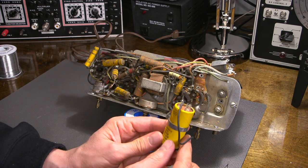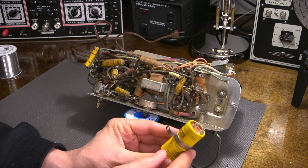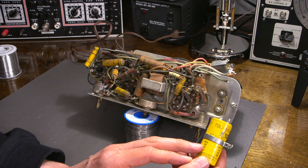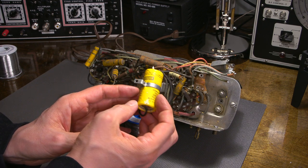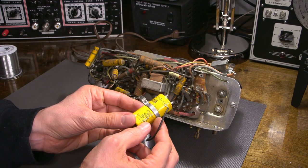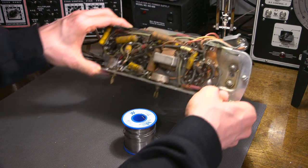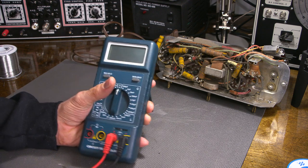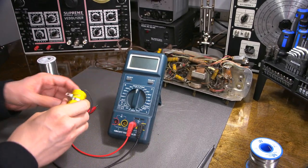I've removed the yellow capacitor out of the chassis. It looks like somebody has used this capacitor as a replacement at some time. The rating is 40, 40, and 20 all at 150 volts - they had color-coded leads: red, green, and yellow. We'll have to find out which capacitor is which on the top. Moving the tester around on this, the common for the capacitor is here, and then we have three different capacitors inside. Attaching to each lead: that one's 57, move over to this one - that's 67, and this one's 20. So we know the 20 is just above the T. So we have approximately 20, 58, and 67 - which would be technically the 40, 40, and 20.